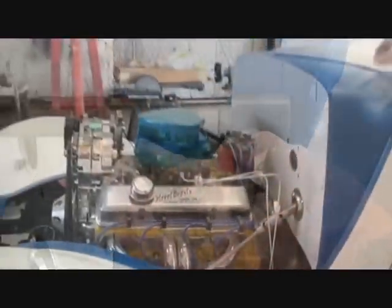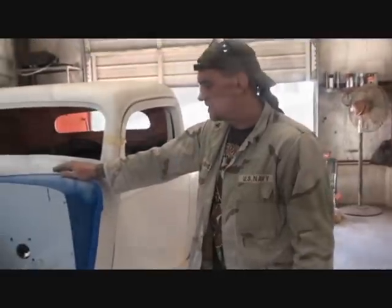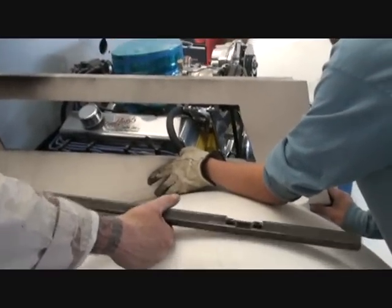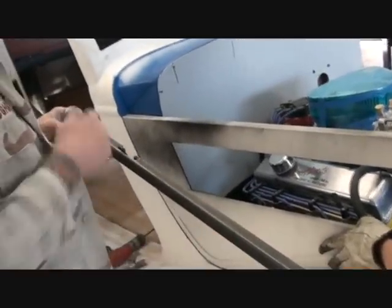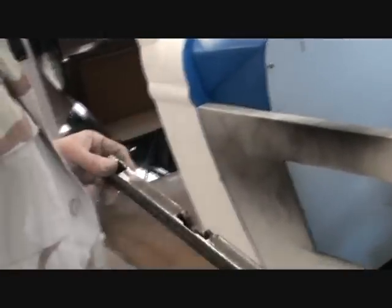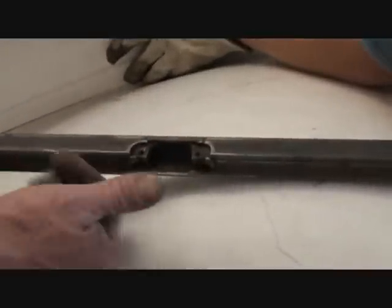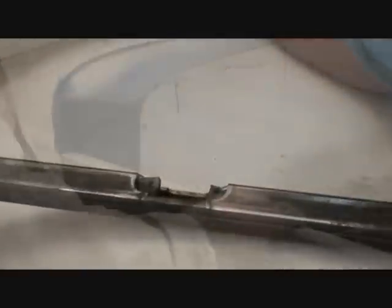So what we're going to do is drill a quarter-inch hole right here, and it's going to go all the way through. Then I'm going to cut a hole out to the other side the same way. My assistant has got all that side hardware done. He's drilled the hole out and made a notch in there, which we'll clean up later, so we can fit a socket down to tighten it up. Now what's real important on the right-hand side is that the opening of the hinges is facing out. If the opening is facing in, the hinges will not work.